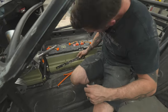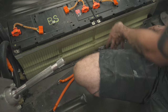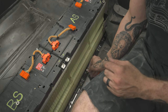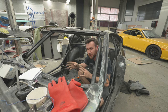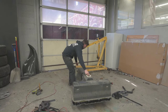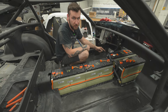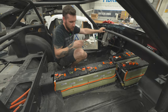These little metal brackets slide in here, you get a bunch of little nuts on there and they keep it from sliding. It's got an almost tongue-and-groove style on that side, so once these are clamped down these batteries are going nowhere. There are two ways to run them — in series or in parallel. One doubles voltage, one doubles amperage. Each Chevy Volt came with three batteries in series, meaning you're running the positive from one battery to the negative of the next: positive, negative, positive, negative — a three-battery chain. That keeps adding the voltage of one battery to the next but keeps amperage the same.